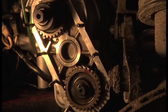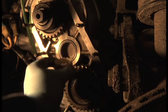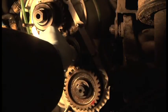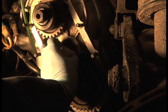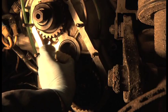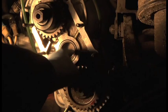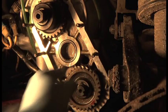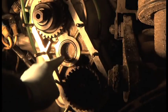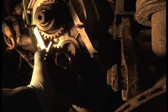So now we're going to just pop the middle one in. Next, we want plenty of our friend Mr. Gear Oil in here. So I just get it in a little cap, and I tip it in and then run it around. There you go. And that makes sure that that race is nicely lubricated and a little bit actually sits behind it. Now I've put plenty of oil again into that thrust race there.